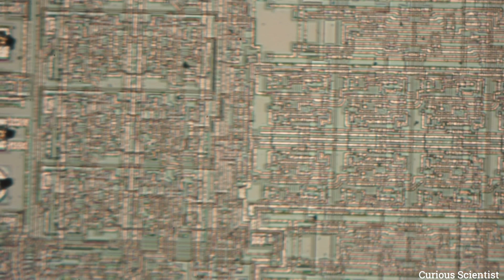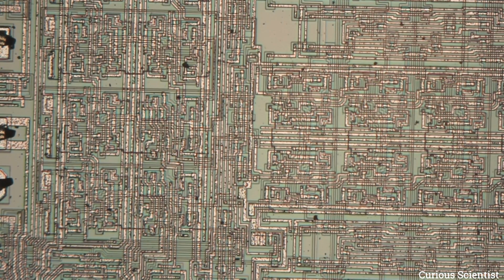So now I put a chip under the microscope and it's out of focus because the Z-axis is high. The system right now is in joystick mode, so I will just twist the joystick to bring the objective closer to the surface of the specimen, so we focus. And I try to move it slowly, so you will see as the object becomes more and more focused. And I went a bit beyond. There we go. So this is the surface of the chip.